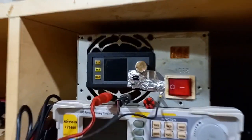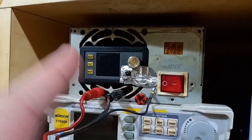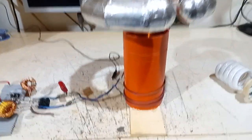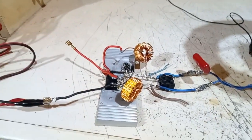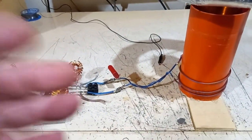As power, I'm using my lab power supply at 21 volts DC, and it's already drawing like 3.5 amps. I'm not sure if I can push it to a higher voltage because in my opinion it's already drawing too much current, and I don't know if something is wrong. Anyway, let's try it.